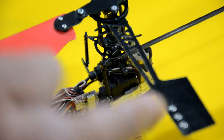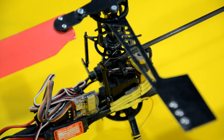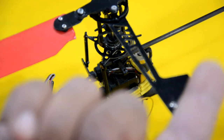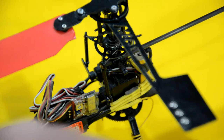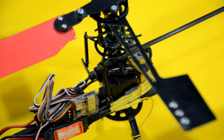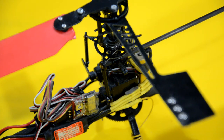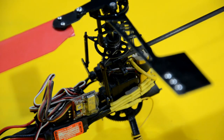Now, because this is a helicopter, if you do a little research and find out how the helicopter works with a Hiller system, this is kind of a Bell-Hiller system. The Hiller system employed paddles to control. By tilting the paddle, you control the position of the rotor in reference to the helicopter, and that's how you affect forward, back, left, and right motion. A Bell system employs tip weights at the end, so this is kind of a mixture between a Bell and a Hiller by employing the paddles with tip weights at the ends. You can go online and find more on that. I don't need to go too deep into that because everything's on the internet as far as that is concerned. So that's how this system is controlled.